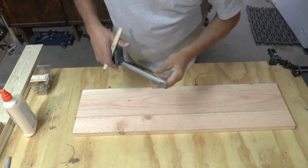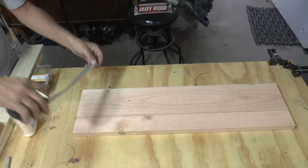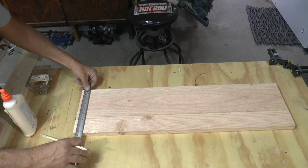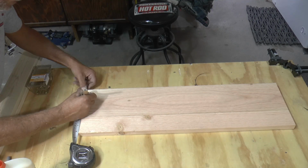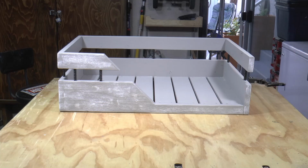The bottom rail has a cutout to the center where the entrance to the bed will be. Measure and mark the center on the lower rail, then measure up 1 3/4 on the right side and mark a line to that center mark. There's only one angle detail cut on this whole piece, and that's on the front, lower, and upper rails.